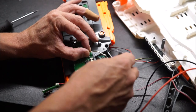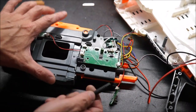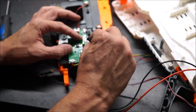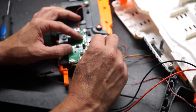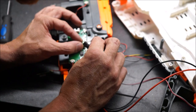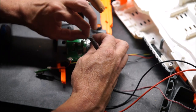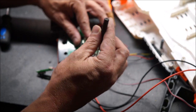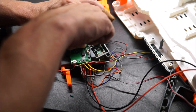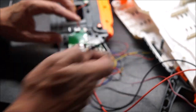There we go, got that. The green would be on the right-hand side if you're looking at the board from the top, or towards the rear of the mech itself. So it's going to go right in here. Stick the screwdriver in, push the wire all the way in as far as it will go, then tighten that little lug until it's tight.